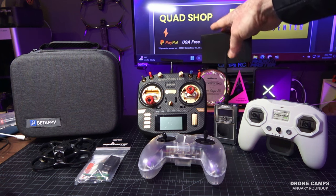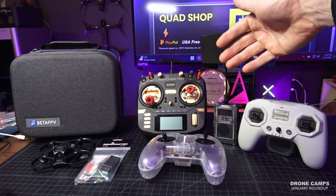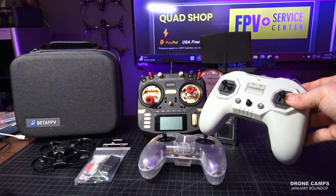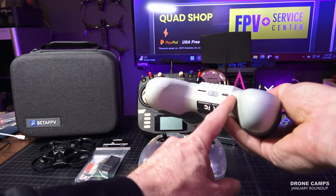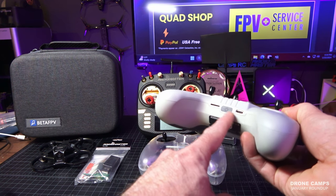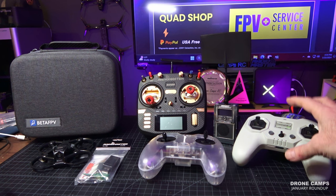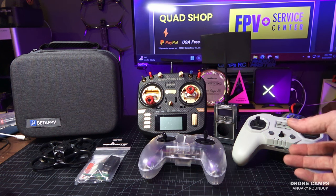The Bandit module is a beast with the Moxon antenna — this will boost your range by about nine times. It is a directional style antenna, so you've got to keep it pointed toward wherever you're flying. Once it goes behind you, not so good. But as long as you stay facing your quad, it's a great setup for close-in, medium, and long range. The Commando 8 Lite is a very bare-bones radio with no screen — just push-button navigation. It has the latest version of ELRS, is updatable with a micro USB slot, has internal batteries, and an SD card slot for models and updates running EdgeTX. It has gimbals you can take off and stow — at $69, not bad.